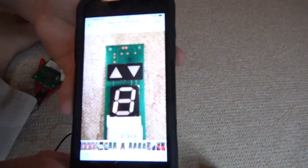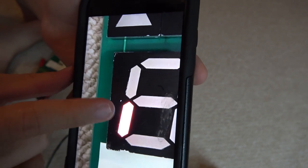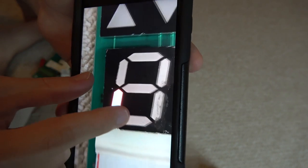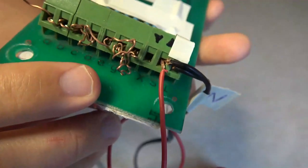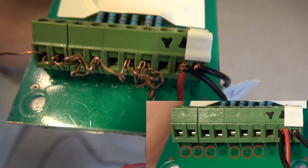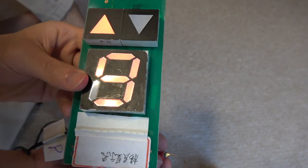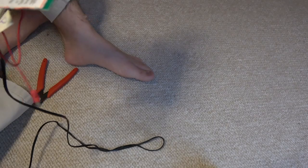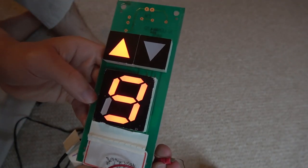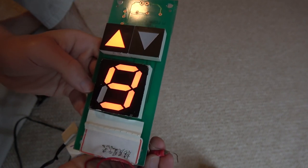In order to make the number 9, this is letter E. All we need to do is take out this part — leave all the rest of the lights on, but just take this off. So all you need to do is unplug E. Just after I unplug from hole E, let's turn it around after I power it up and pulse it to see what we've got. Finally, number 9 — the last number of the single digit indicator. Let me turn off the main light. We're at the last number of this single digit floor position indicator. We made it all the way up — wasn't that fun?